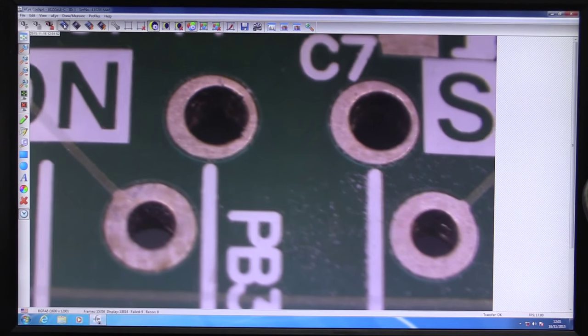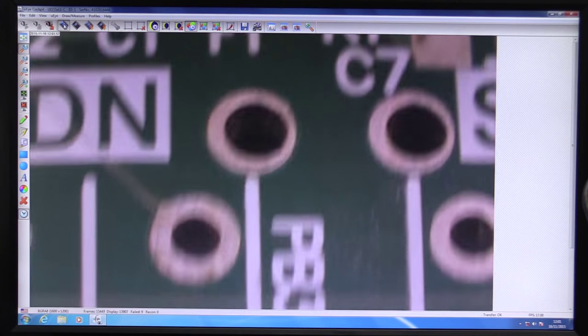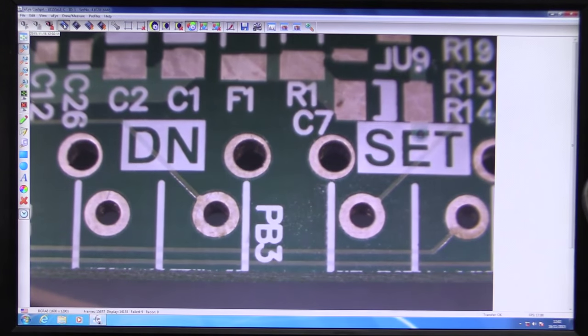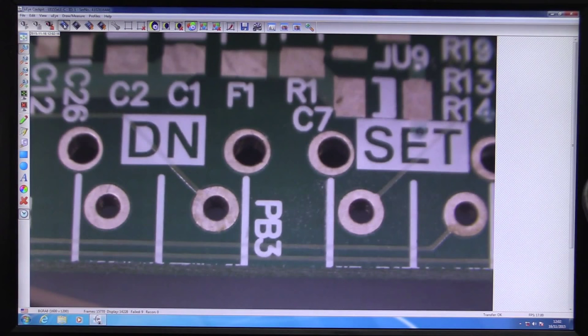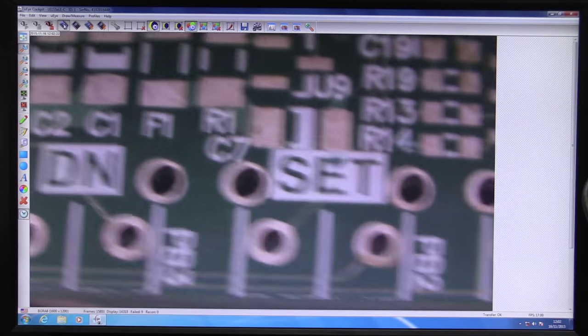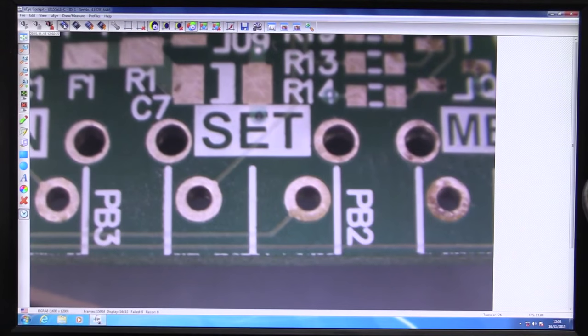It's a vision inspection tool and for live soldering. I mean, this microscope is absolutely unbeatable for live soldering, and I can just flip that lens in. There we go. So that's the times 4, and that's our times 8. You can see the difference. Typically, you would use the times 4 lens for most general purpose SMD soldering, because you get a bigger working distance, you get a larger frame on there, you can see the iron coming in. It's good enough for like 0402 and stuff like that. But when you're inspecting 0402 or smaller stuff, usually I won't live solder with the times 8.